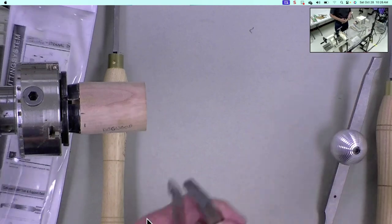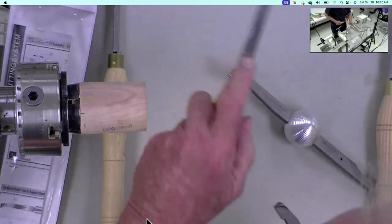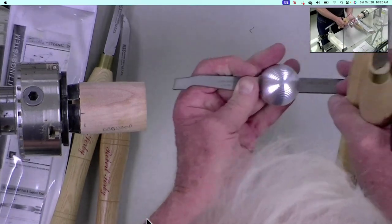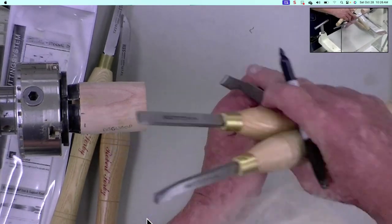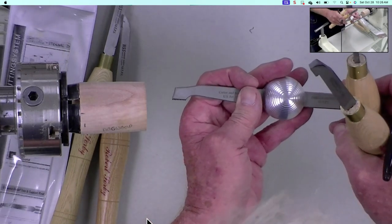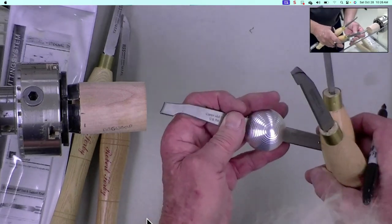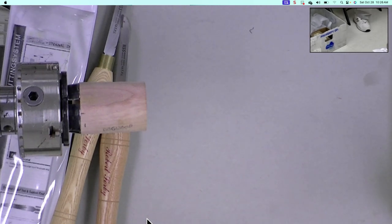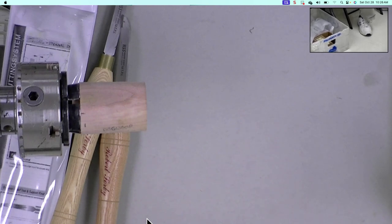So let me just pass these around. And by the way, on the Carter and Son, if you're into the internal female, you see how they've got that arced back? That's advantageous to you as well, because it enables you to pull out. Follow me? So let me pass these around. Yes, these were designed by Mike Mahoney, but they're made by Carter and Son. I've only used this on a couple of little items, and it seems to work really well. Mike is real big on double-ended tools, of all kinds, and that's his design.